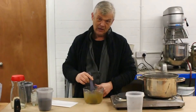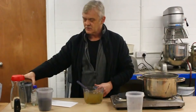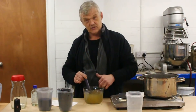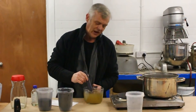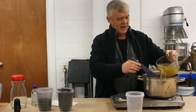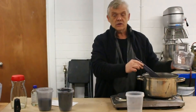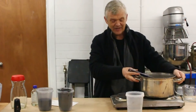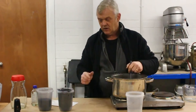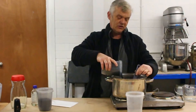All we need to do now is add the active material. In our case we're going to add 300 grams of 5 micron flake graphite — high-quality graphite, so it's going to give a relatively high-quality ink. Add the 1 litre of binder to a pan, because we're going to have to heat it. Heating ensures dispersion and helps degas it. Put it on the heat, and when it's hot and beginning to boil, add your graphite.